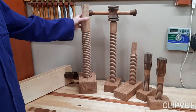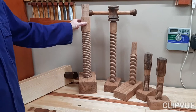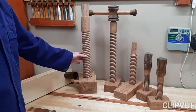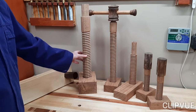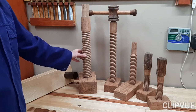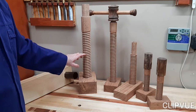On the left hand side we've got the one for the leg vise. Once done it will be 600 millimeters long, 64 millimeters in diameter, and the pitch between the threads is 12 and a half millimeters. However it's a twin start screw, so that thread when it comes around comes to this one over here. So for every full revolution of the screw you will have 25 millimeters of advance.